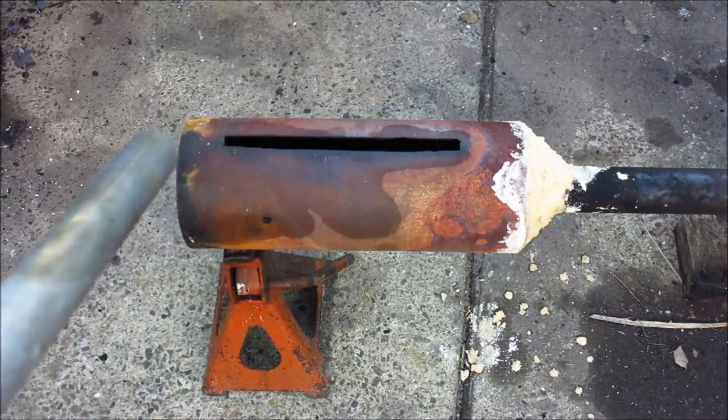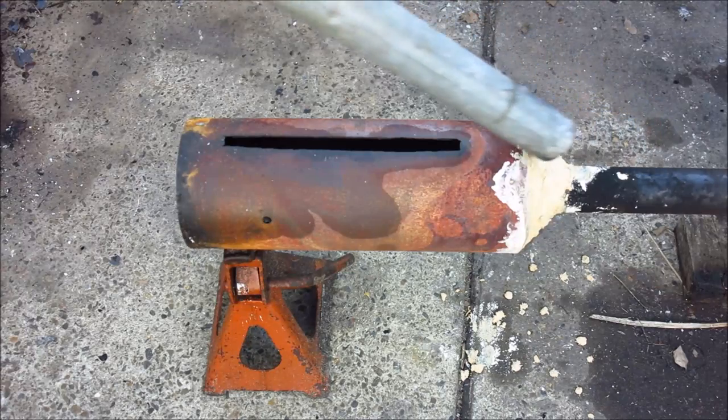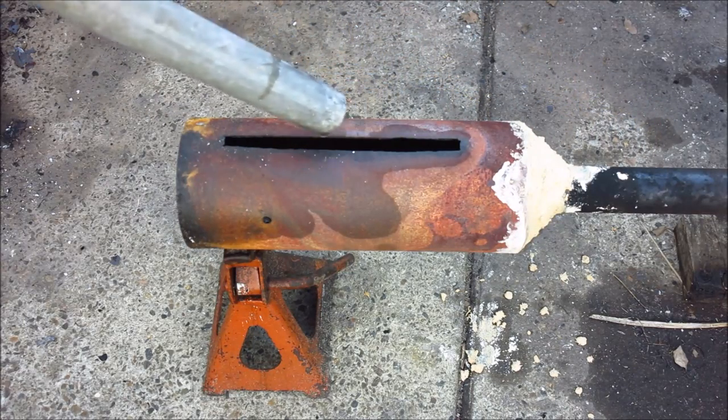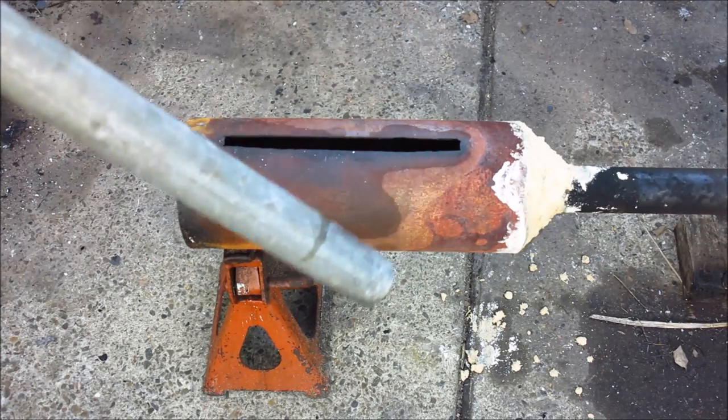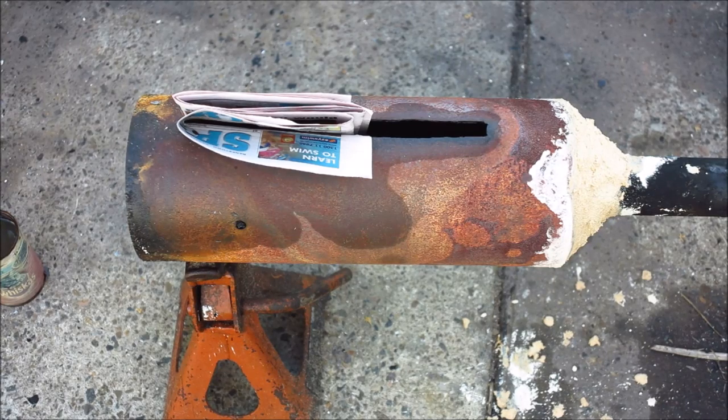One of the good parts about this is because you have this open slit it's very easy to fill it with some startup fuel. I'm going to use a bit of veg oil mixed with diesel — the amount isn't critical, just enough to start it off and get the heat in there. The pipe comes along inside, gets preheated, and you also have the surface area of the extinguisher, making it a double heat preheat system which makes it very easy to start up and burn really efficiently.